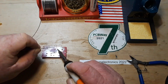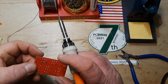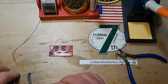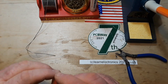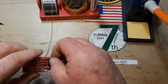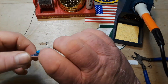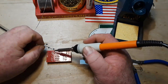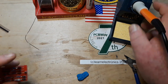A couple of things: number one, I thought I had 47k ohm resistors because I had a drawer marked 47k ohm with a package of resistors in it. But when I went to put them in the board, they were actually 470k ohms — can't use those. That's why you're going to find a big one-watt resistor sticking out of there like a hangnail. Everything else went together pretty well, and we're going to find out in a minute how it went for real. It's always nice when it works the first time, right?